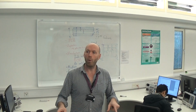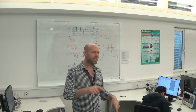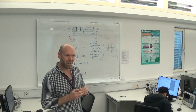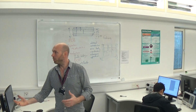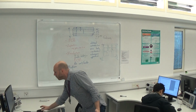And the third thing that they might come back for is they found a short circuit on your board, yeah, which basically means that you've ignored the DRCs in Ultiboard, because Ultiboard will also tell you that there's a short circuit here. So quite often, like compilers, somebody will press compile, see that there's something red on the output, and then not actually read it, but come and say there's something wrong with my source code. But the DRC will tell you what the problem is with your board, so it's important that you look at that and you rectify that problem before you upload those Gerber files. Because if PCB Way has come back and said, look, you've got a short circuit on your board, it's rather embarrassing.